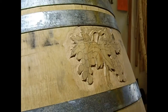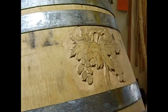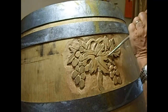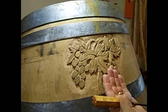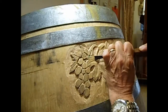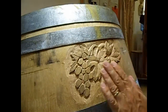After I have the background down, then I start going and outlining the details of the carving. I start with the background, and now I'm working from the back forward — cutting all the deepest areas moving towards the front. In doing the contouring, I'm working down to the bottom of the V tool cuts, the stop cuts that I made, not leaving any flat spots.